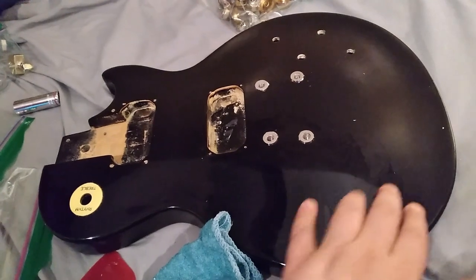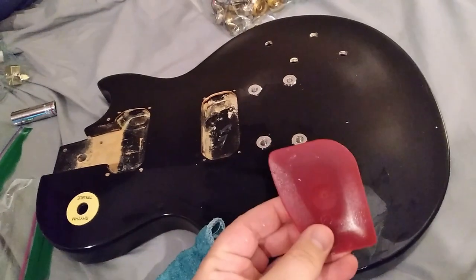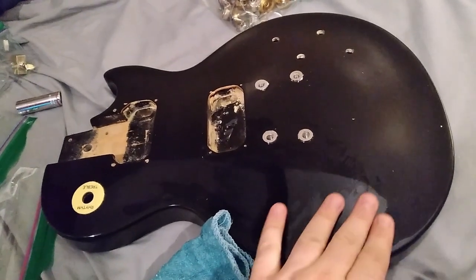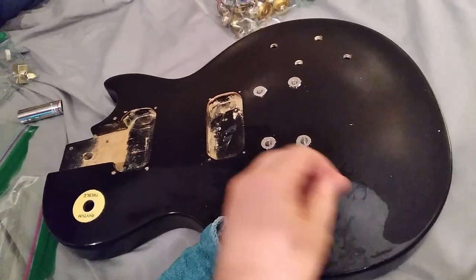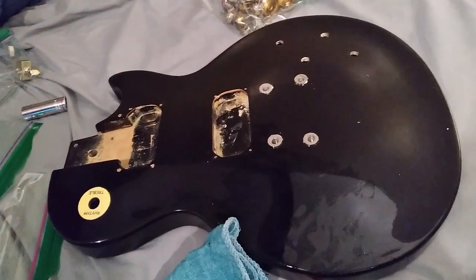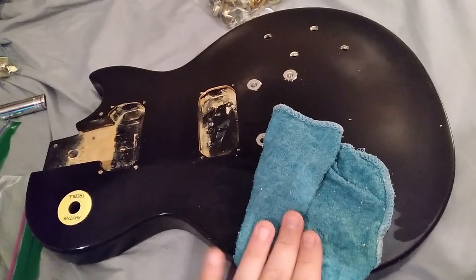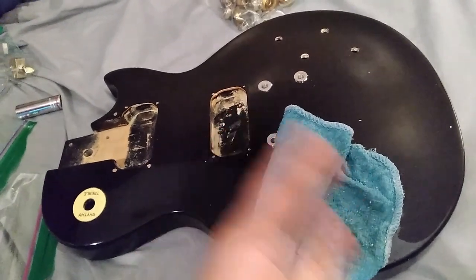Once I got the boiling water on there and left it on for about 20 or 30 minutes, I took the plastic scraper and just started scraping, and I started catching some of the edges of the paper, the pictures that were Mod Podged on here. When you got the top layer of Mod Podge, you could kind of tear that off, and it would bring up some paper. Once you got the paper wet, it was really easy to get that off. It was a matter of sometimes putting the cloth on the counter with some hot water and having it flipped over so that it didn't run.